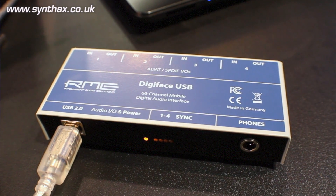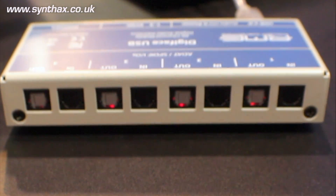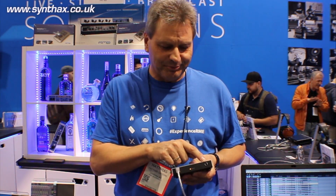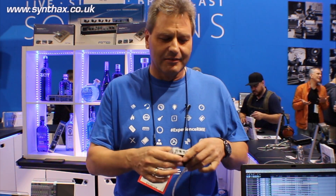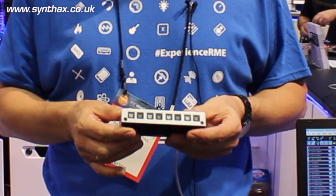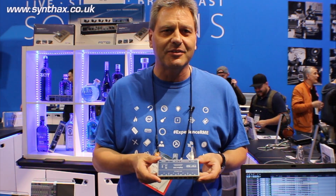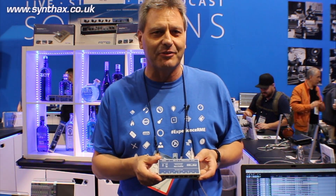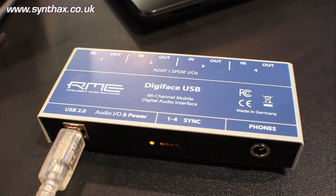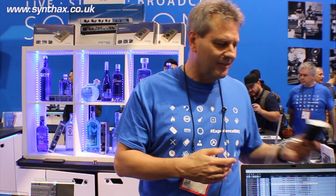And here it is. Small, lightweight, 220 grams only. It has four ADAT I/Os — that means 32 channels on ADAT — and an additional high-quality headphone output. Same technology as in the Babyface Pro, and just USB bus-powered. You can also use any of these I/Os as SPDIF, so connect one, two, or three SPDIF and one ADAT — any combination is possible. This one runs on TotalMix FX but has no FX included, so that's the normal TotalMix routing and mixing. From multi-channel applications up to just using this as a headphone box for on-the-go mobile use, everything is possible.